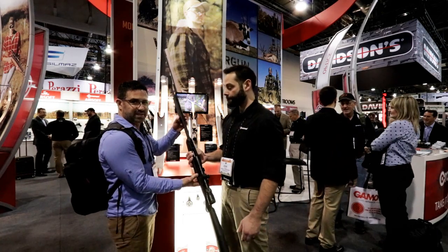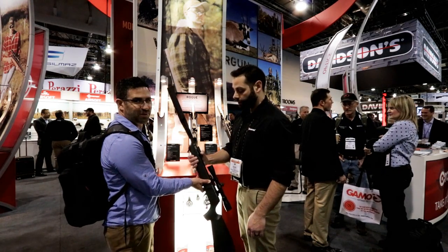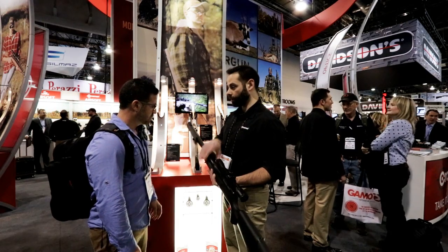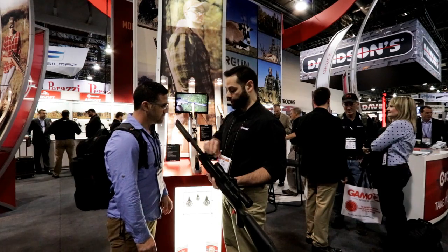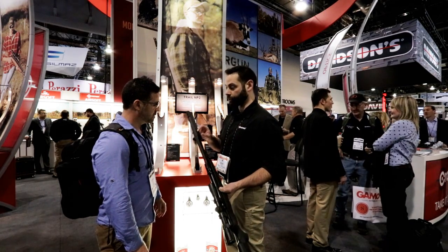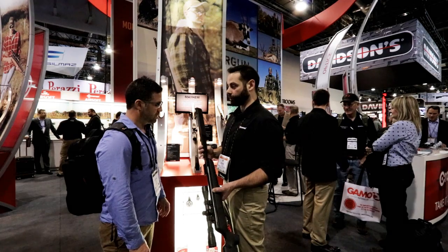Looking at the side profile of this silencer, there's a lot of volume there. One unique thing — and this is patented, no one's done it before — is we've actually over-molded our barrel breech assembly with a glass-filled resin. The baffles themselves underneath the shroud are over-molded, so it's all one piece. The shroud is aluminum and just comes right off. You take the end cap off — the one that has the front sight — slide the shroud out, and that exposes the barrel breech assembly.